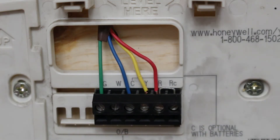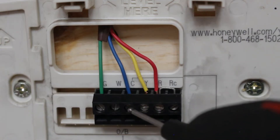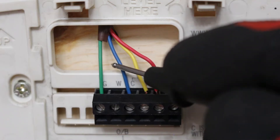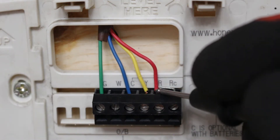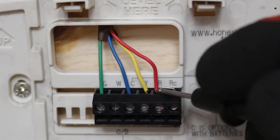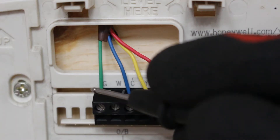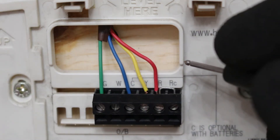If you really think about it, a thermostat is just a large relay. Once you understand how a relay works, life begins to make sense. C is always going to go back to one leg of your secondary on the transformer, and R comes from the other leg of the secondary of your transformer. But as I said, this is a relay, so your power wire is going to be changing around — I'm going to explain that.